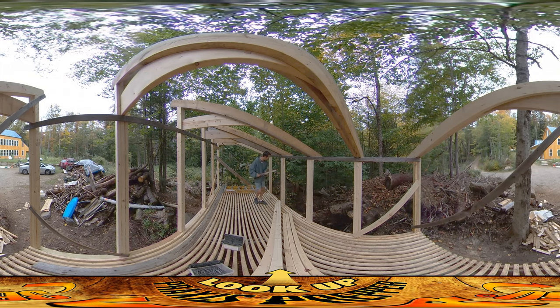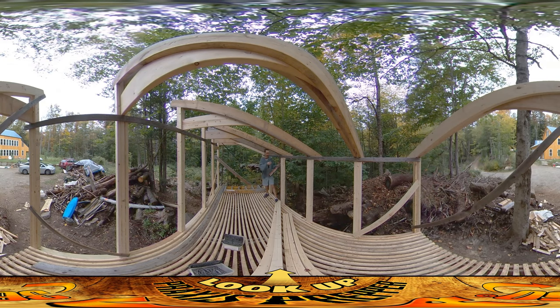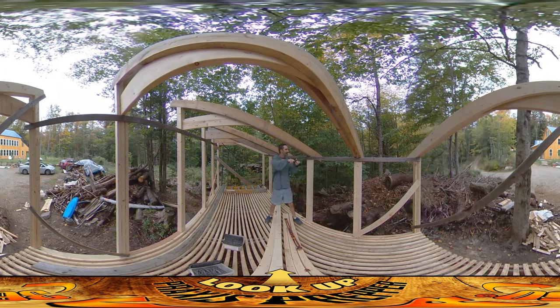I'm going to skip past this one and now do this post. Once this is supported I can pull that and then get that one good. This one is also leaning towards me, so I'm going to take the nail but favoring it in my direction a little because I know I'm going to be pushing the post that way. If I needed to pull it I'd put the level on the other side and kind of pull it with my hand. I do need to pull it, so I'm going to pull the thing towards me a little.